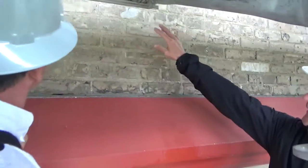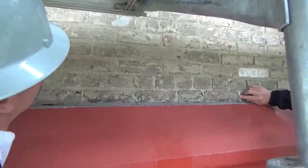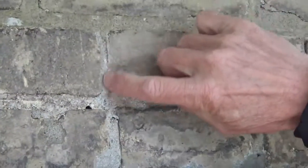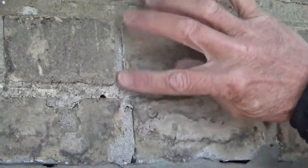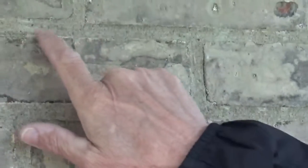Yeah, this area here really tells a lot about the building, because I do agree with you, Tom. If you rub the original mortars, you get the white color of the lime showing. Of the lime bleeding, eh? But you see a cementitious, much like the parging that was put on the buttress. Yes. Somebody's smeared over top of the mortar, that mortar campaign. Then there's this other mortar campaign that was more decorative. They try and get that rope pattern in here.